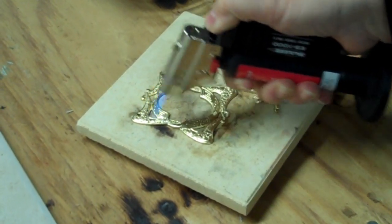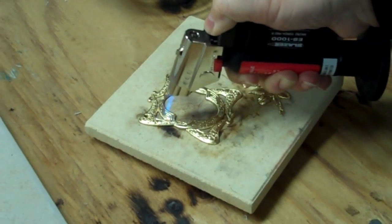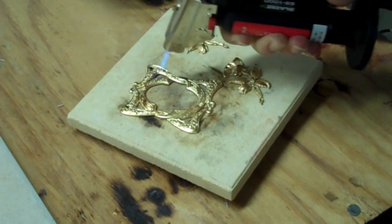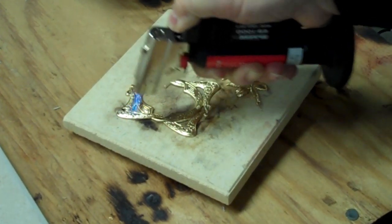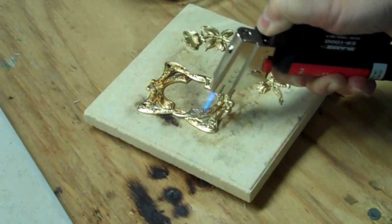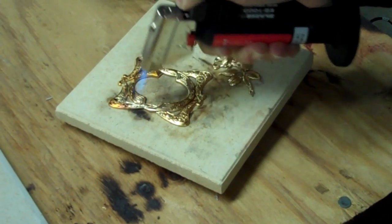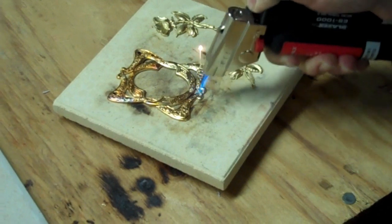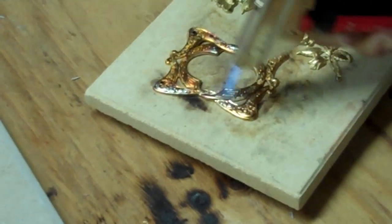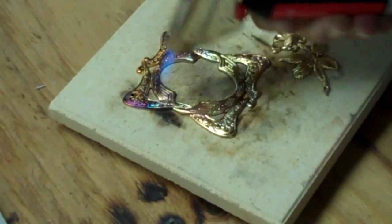This is going to take a little bit. I'm heating the piece up really good. It takes a little while to get it really started. Don't worry about the smoke coming off of it — it may just be a little grease still on the brass. Get your raw brass good and clean, though in this case it's not as important. Sometimes a little bit of that machine oil residue can actually help you get a little tooth with the torch. Can you see how it's iridizing? We'll want to get this until it's almost glowing red.